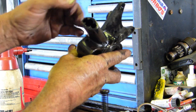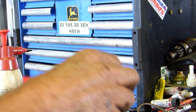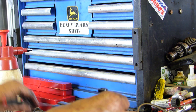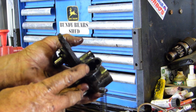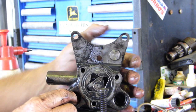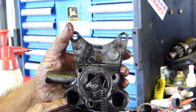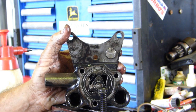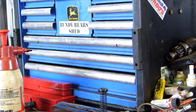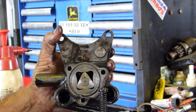There's nothing else down there. I was expecting to see some shims of some sort - there are no shims in there. They must be able to machine them that accurately nowadays. I didn't see a filter bypass valve or a relief in the filter housing, so I'm presuming this does everything. So there you go, that's what the oil pump looks like - grubby looking thing. We'll be replacing this - it'll just go into scrap from here.